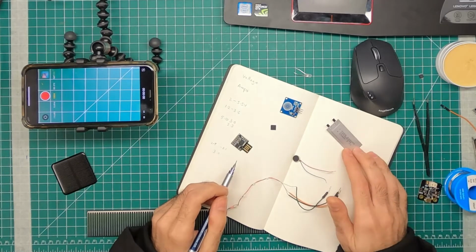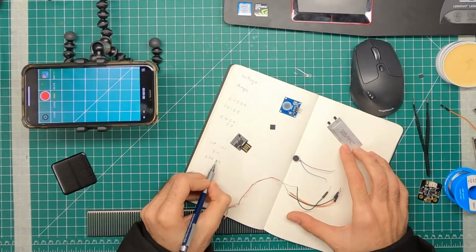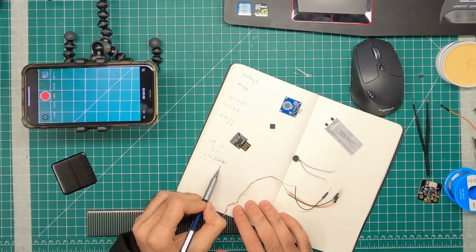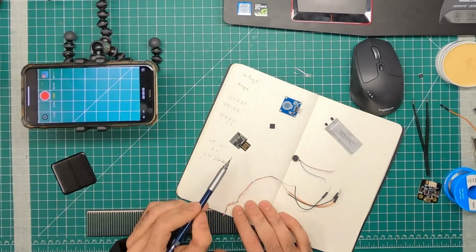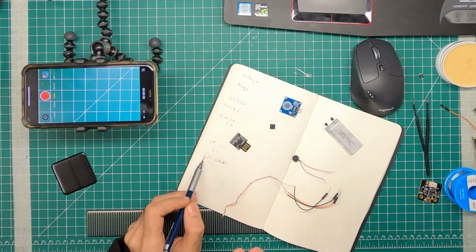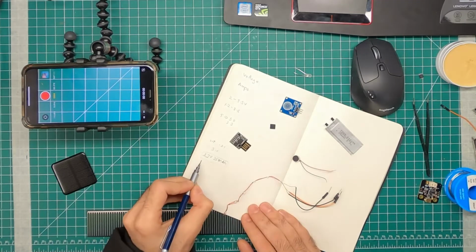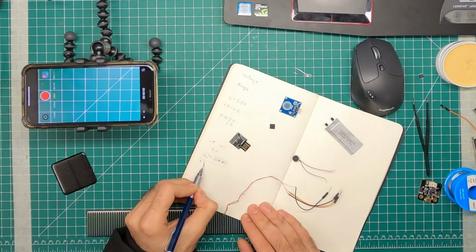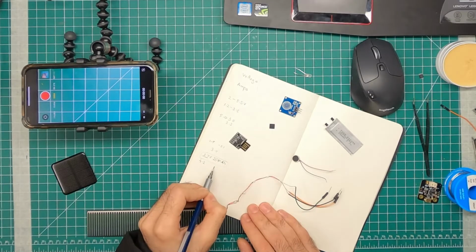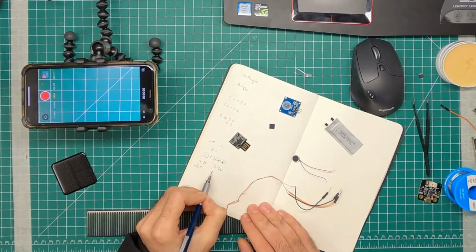But then you realize that my lithium battery says it's 3.7 volts and has 25 milliamp hour capacity. We'll go into what the capacity is all about in a bit. But 3.7 is the nominal voltage, which means it's about 40-50%, 60% charge. Lithium ions, when you charge them up to max, go to 4.2 volts. So that's your problem. You can't feed 4.2 volts into this when your battery is 100% charged. And when they're discharged, this number goes down to 3.2 volts. So this is full, and this is when your battery is empty.